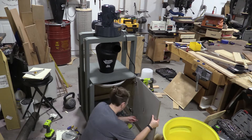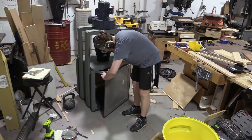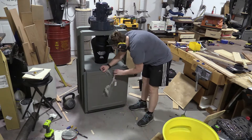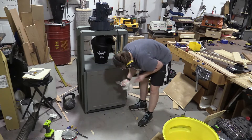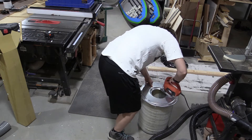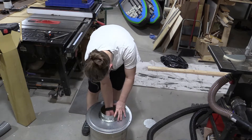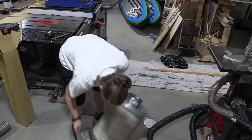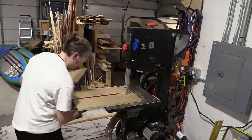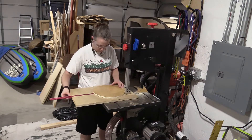I'm using reclaimed hinges that I got at Restore — about 25 cents a piece. The door and the paint aren't a perfect match, but it's just paint I happen to have laying around. For shop builds, I usually just try to use materials I already have. My closest big box store sells duct collars in either 4-inch or 6-inch, not 5-inch, which is what I need. So I'm going to use a 6-inch collar and then a 6-to-5 reducer to make the 5-inch hose from the filter side of the motor fit right into the filter. I used a shop-built circle cutting jig to cut the circle for the bottom, but this doesn't have to be a beautiful circle — you can just draw one out and cut it by hand.